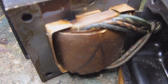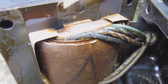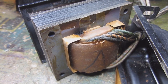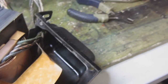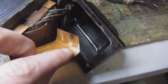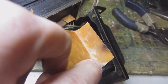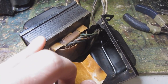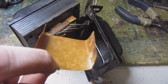The transformer is apart here. As you can see, here's where you're having some arcing going on right here — it's all the way in the center near the core. So this isn't going to be fixable. I'll have to pick up a new replacement suitable for a parallel push-pull 6V6 output design. Here's another place where you can spot it: on the back of the insulator here you will see right there where it was arcing — the burn mark. This is exactly where it was lining up, producing leakage to the case. This is happening on tons of these old transformers now that are hitting this 60 to 70 to 80 year age range. They're all starting to break down no matter how they've been cared for. At this point you need a replacement.